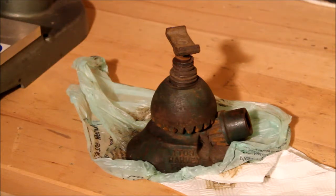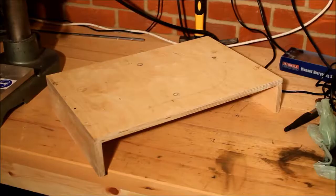I hit one minor problem — I did a test fit with a jack out of my car, and the jack will lift the drill, but the downside is it also pushes the drill forward. So I need to be able to sandwich the jack between the base and the motor in order to jack it up and down safely. This is where this wooden piece comes in — I made it about a year ago to sit over the top of the Sky box in our house so the kids didn't stand on it. I thought if I could sit the drill on top of that and bolt the drill down to it, I could sit the jack out the back and use it to sandwich the jack between the drill and the base.